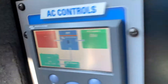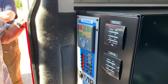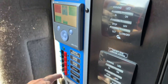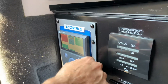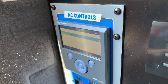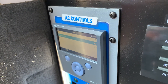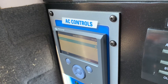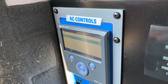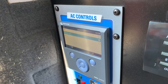I'm going to talk a bit about the shutdown. So we're going to shut down the truck at night. I'll turn all my AC off. I'm going to go back to my menu — it's on switch, so I'll hit switch. Right now it's on charger only. So if I'm going to leave it in a bay with shore power and I want to keep my refrigerators energized or the chargers energized, leave it on charger only. That way, if somebody inadvertently unplugs the shore power, the batteries will not continue to draw down.